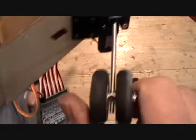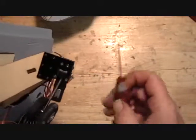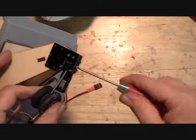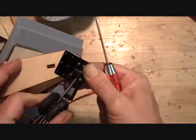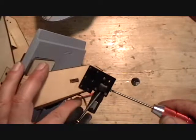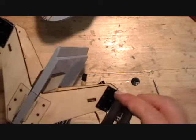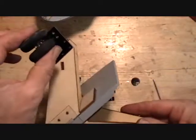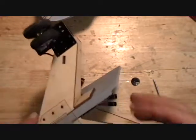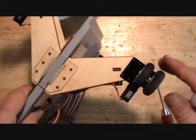And then with the gear in the down position, this one's jammed up too. This one here on this side, I got the axle too deep here too. And I'm not sure these gear have, some of the more expensive gear have circuitry in them that stop them from binding. I'm not sure these do. I've never had one burn up or anything, but you don't want to get these to bind. You want to make sure they actuate freely.